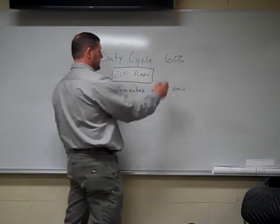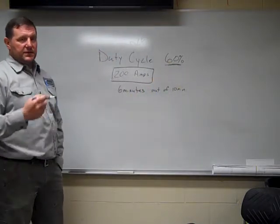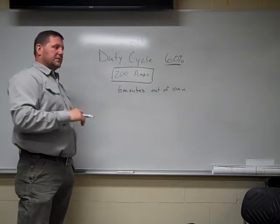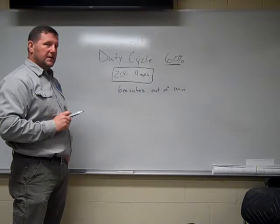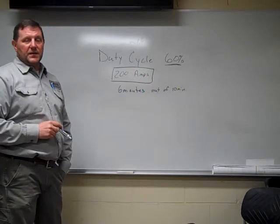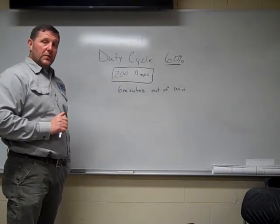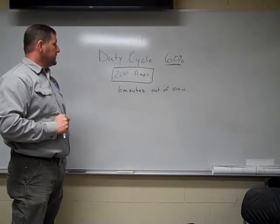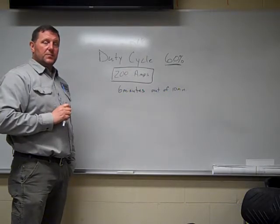Typically, you never reach the duty cycle out in the lab, because you're always either tacking something up, so your machine's never running at max output. For example, if you're stick welding 7018, you're probably going to be set at 120, 125, maybe 130 amps. So you'll never reach that max output. So that's what duty cycle is. That's how long your welder can actually run at max output.